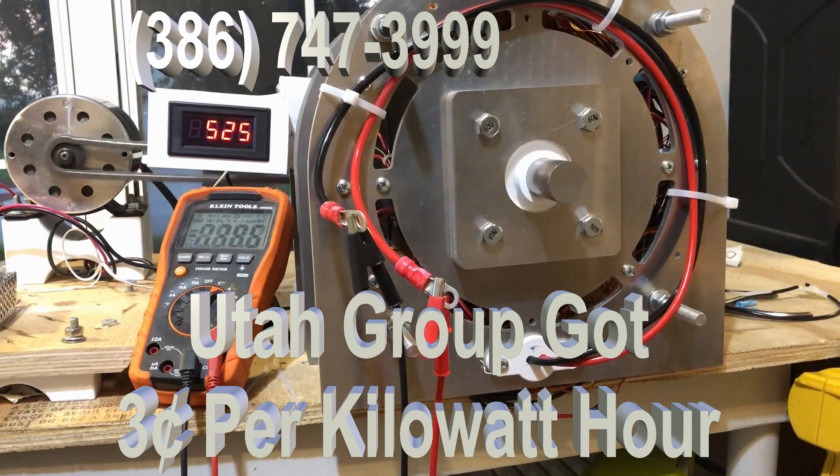There's 520 or 525 RPM, and I've got 138 volts. If you go higher, it's a linear voltage. See that? So we're at 189–190 volts at 720 RPM. So you take 190 volts, square it, and divide that by let's say 10 ohms — you're at 3,600 watts.